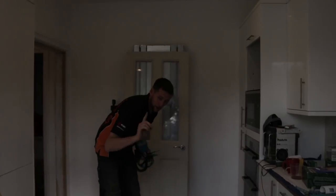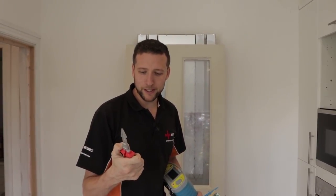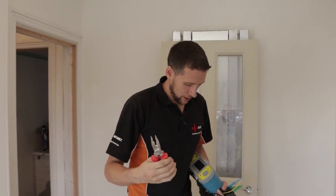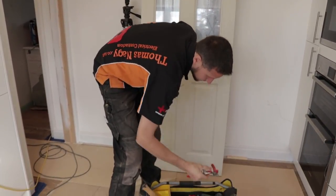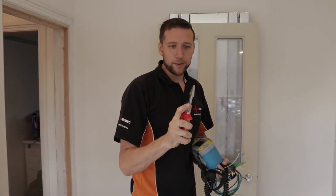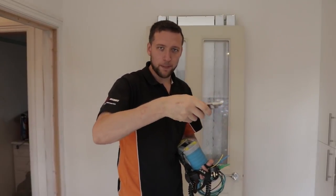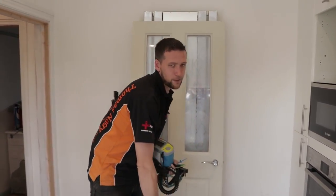Let's go inside and do the next job, which I think is the upstairs lights. Those are snips a subscriber sent in for me to try. They sat in my bag and I didn't really use them to begin with because they're just not as versatile as the normal snips that I use - a little short 160mm pair of cutters, those are my go-to. But I have been using these and I find they're better for things like data and telephone - they've got a really nice flat nub on them on top so you can pull wires through pipes and stuff. I am starting to come around to them. They're not cheap - they're about 65 quid - but I'll keep you posted on what they're like.